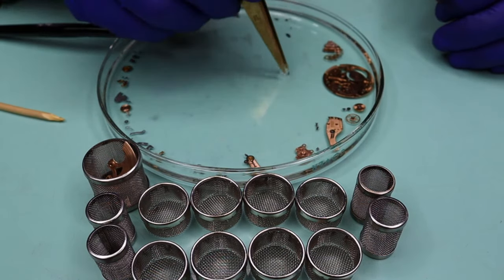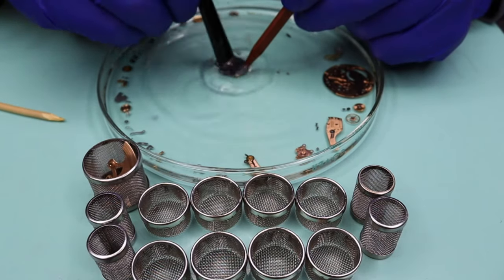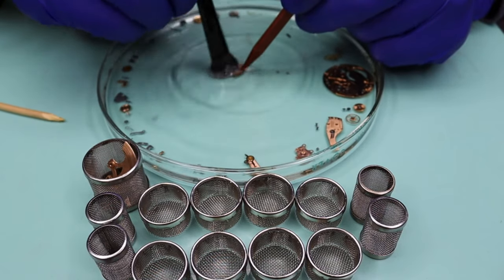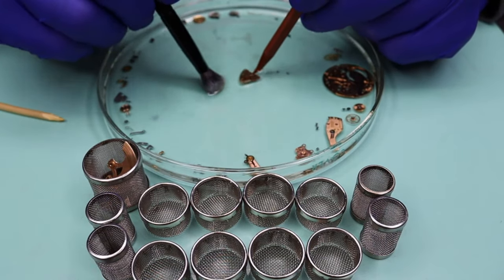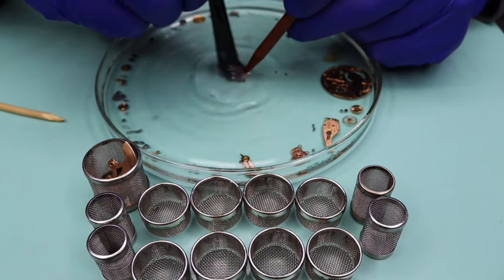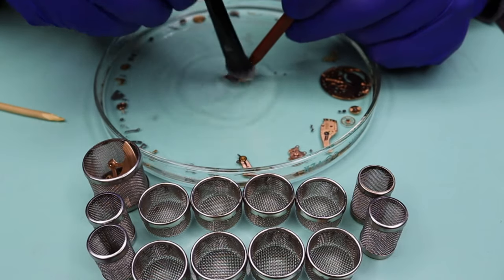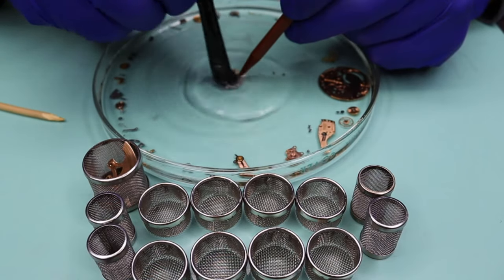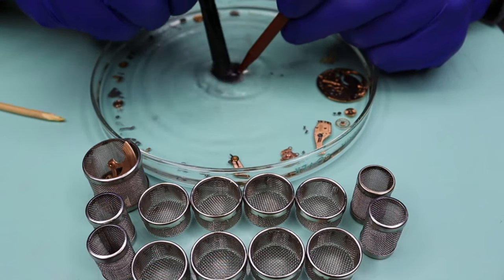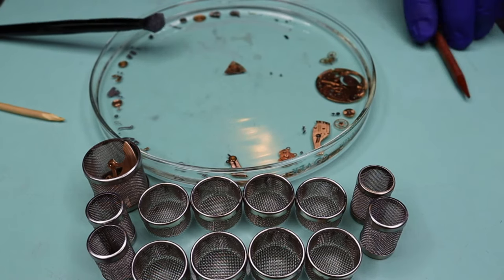Next, I'll do the train bridge. If you guys have worked on watches before, have you done what I'm doing here, is bathing it and cleaning it in alcohol first or another? Some people use naphtha gas, which is just a white gas. It's like Coleman fuel. I tried that. It stinks. So I use alcohol. Alcohol stinks, but that naphtha gas is horrible. So alcohol for me. But I've heard that naphtha gas from like an old watchmaker.